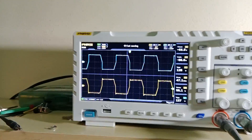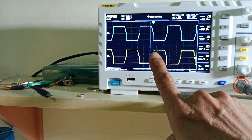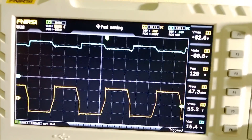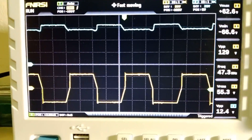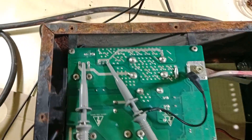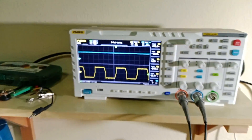This is the correct waveform. Next, I move one of the probes to the cathode of the fast recovery diode and we can see this output waveform has an AC component superimposed to the DC level. This condition makes welding unstable. I replaced these two high voltage capacitors which are connected to the fast recovery diodes and that fixed the problem. Now you can see that the output is a clean DC — it's just a straight line with no AC component, just like it should be.